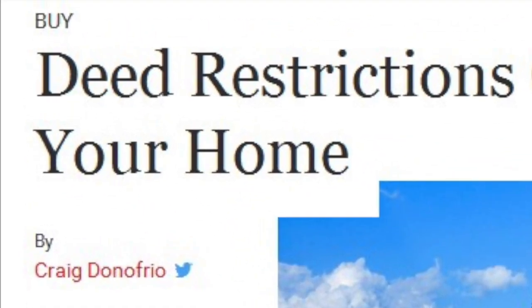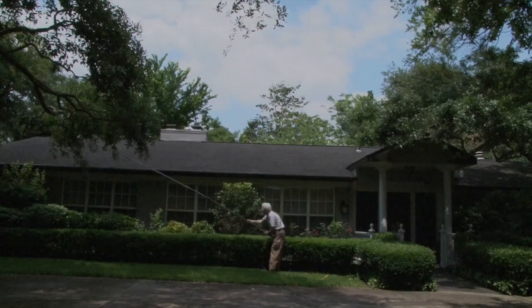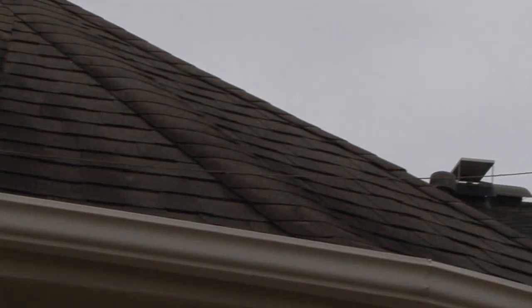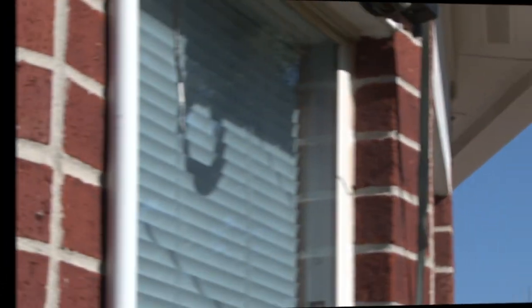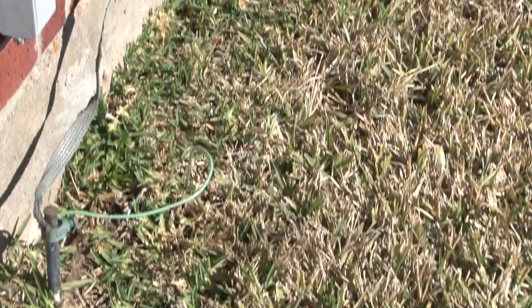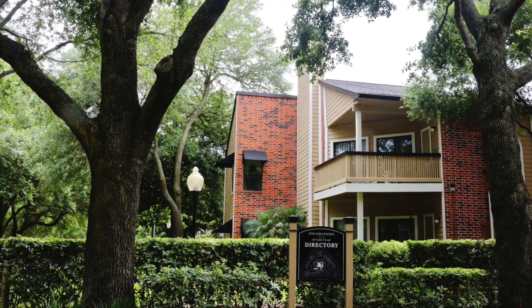If the deed restrictions are enforced, just put it down and put it back up when they leave. After a while you will probably get away with just leaving it up. Also easy is the random wire. Put the tuner under the eave of your house and run a wire anywhere you can — just get it up as high as possible. For the other half of the antenna, run a wire down to the ground to a ground rod, or connect to a wire around the foundation of your house. If you're on the second floor, just run a wire to the foundation and a ground rod — its length will serve as the other half of the antenna.